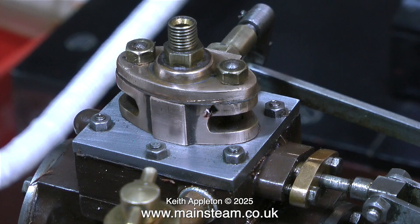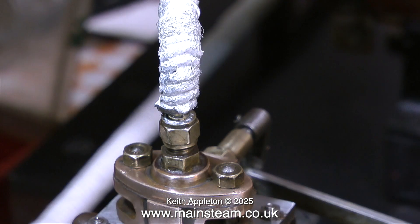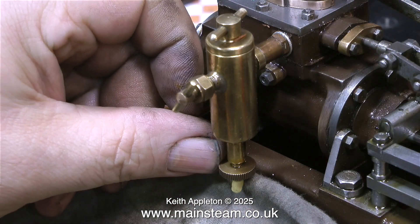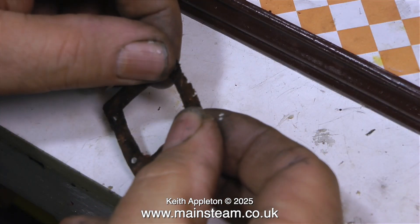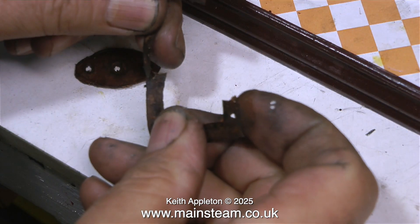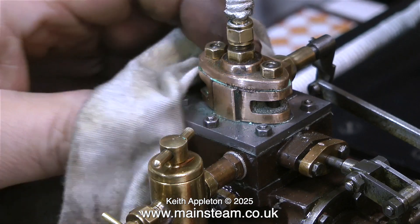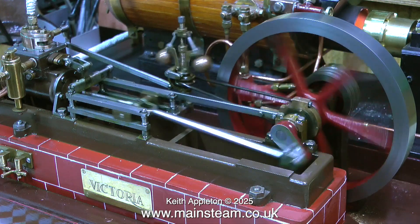All I need to do now is refit the steam pipe and raise some steam. As the boiler was still quite hot from the previous run there was soon sufficient pressure to drain the displacement lubricator. When I ran the engine it was fine, so I dismantled the steam chest again, took out the old gaskets, made some new ones, and fitted those. After giving the parts a quick clean up with a cloth, the engine runs — this is perfection, well nearly perfection, nothing's totally perfect.